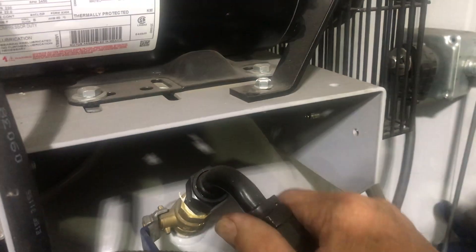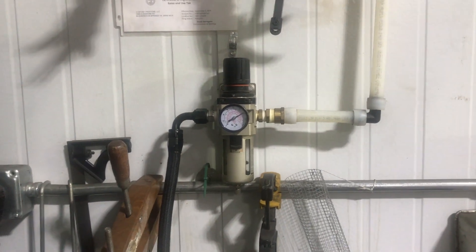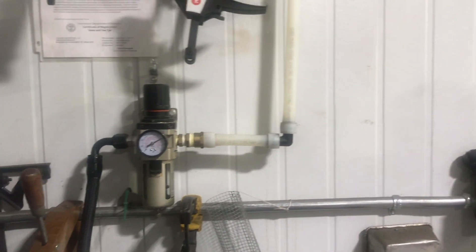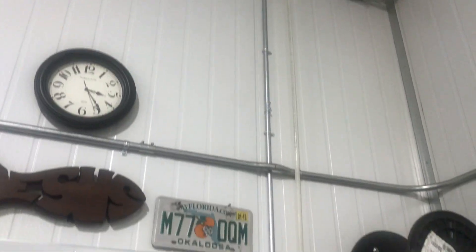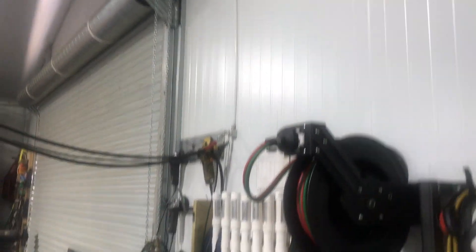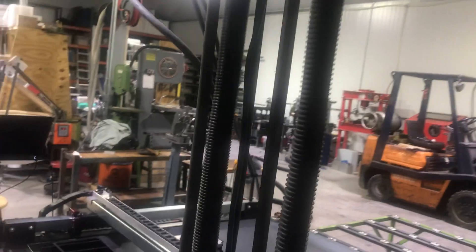Here is the supply line with a petcock that goes over to a regulator — I regulate to about 120 PSI in the lines. I'm using PEX expansion PEX that goes all the way around the entire shop up at the top, and then drops come down with PEX at various locations wherever I need an air supply.